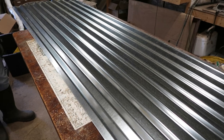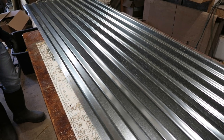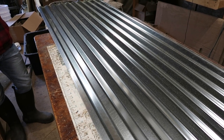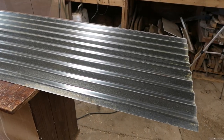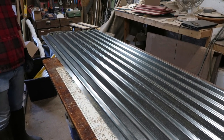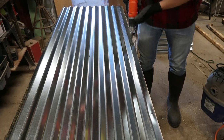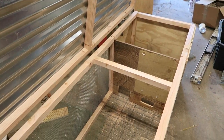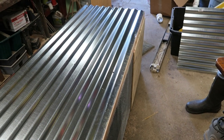Getting near the end — we're going to use this piece of galvanized steel as the cover. If you're buying all new materials, this is probably one of the more expensive pieces, somewhere between $20 and $25. But if you have access to used roofing materials or old pieces of steel, by all means use that and you'll save even more money. Gavin's putting in the final screw for the lid. The hinges are on, divider in, and our last step is going to be to put a handle on it.